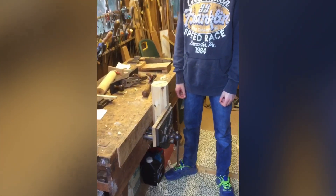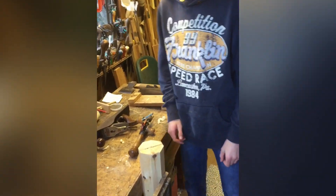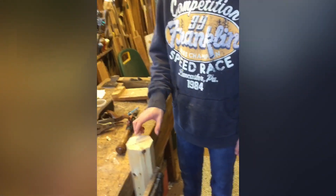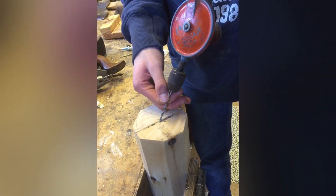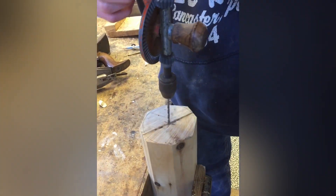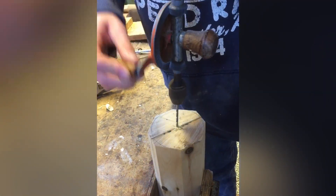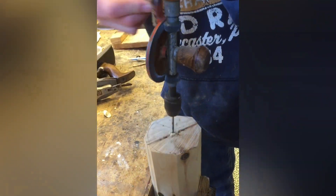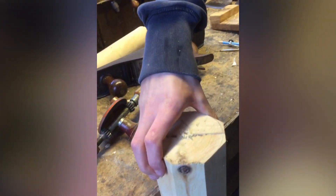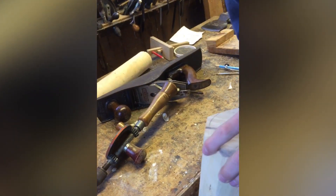Shed hacks and the next stage is the turning on the lathe. So we've established the centre of this block using a compass and now we're going to drill a three millimetre hole with a hand drill — we'll do that on both ends, about a centimetre deep. And this will now go on to the lathe, ready for turning.